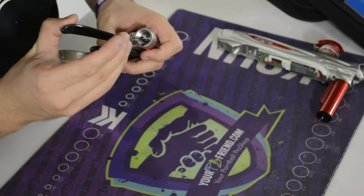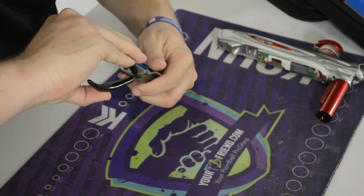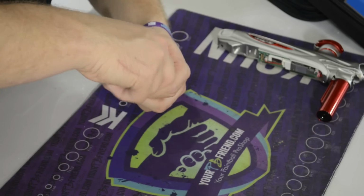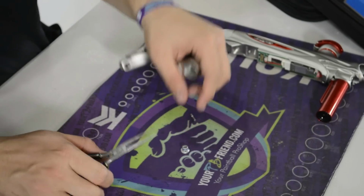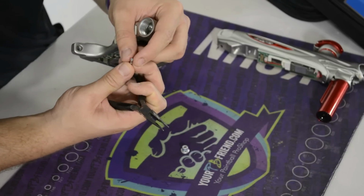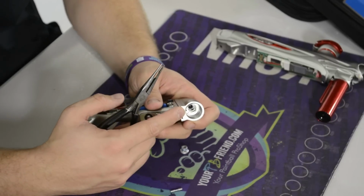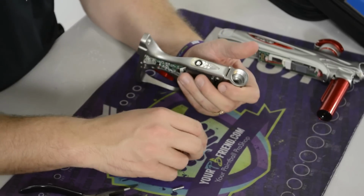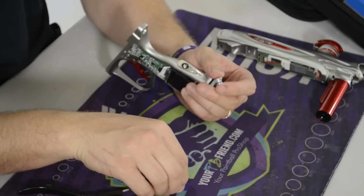On the inside of the ASA, there are two holes. You can take it and they twist. You don't just pull out, you can twist off the ASA. And there's a few O-rings. You have your pin, which is almost identical. There is one O-ring inside there. I believe it's a 006, but it is on your die chart, I think. So if you're having an ASA leak, that's where it would be, or this blue one right here.